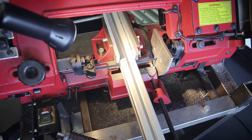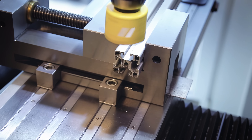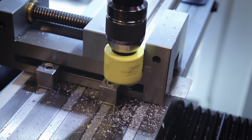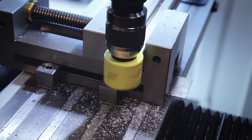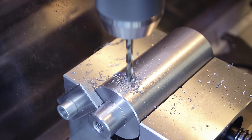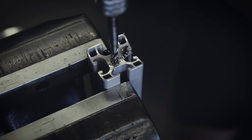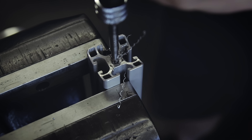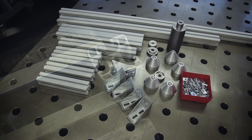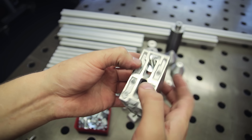Here's the finished post and now we can start assembling the jig. This is just 40×40mm T-slot profile — you can get it from different brands but they all work the same way. The good thing about aluminum extrusion is that it's generally very straight and accurate, lending itself well to this purpose. How long these pieces need to be depends on the kind of frames you want to build, and since everything is adjustable the exact length doesn't matter much unless it's too short. One extrusion piece gets a miter on one end to interface with the bottom bracket post, and the post also gets a hole straight down the center. The extrusion pieces are designed to have threads cut into the ends, which we use here to attach them to the post.